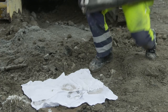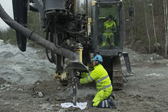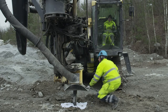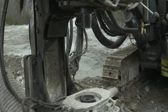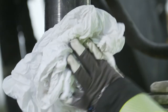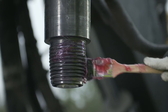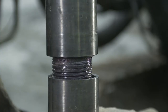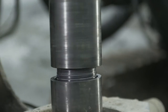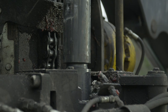Place a cloth on the ground to ensure the new head doesn't get dirty. Place the COPROD head on the ground and clamp it to the breakout table. Lift the head off the ground and align it using the drill rig. Bring the COPROD section down towards the head. Wipe the tube thread with a cloth, then check and grease the thread. Attach the head to the tube and turn until there is a small gap. Take the COPROD head to the breakout table and tighten the thread.